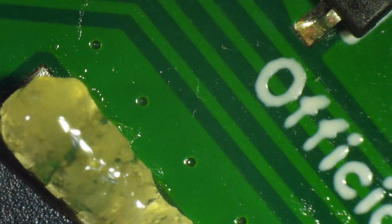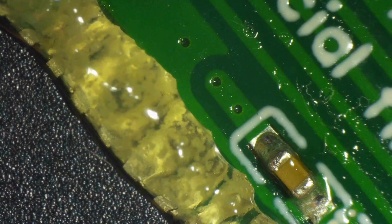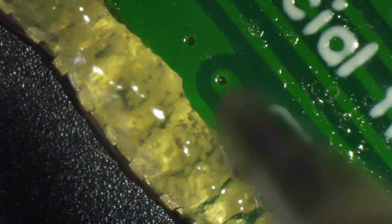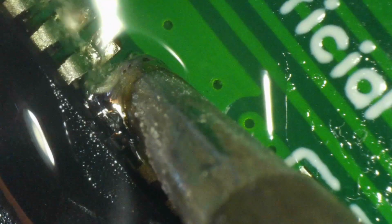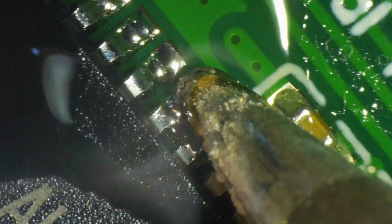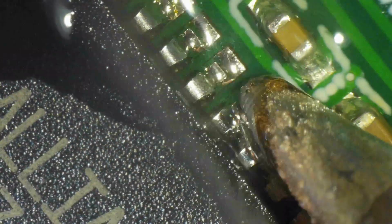So what I would do, not to compromise the stability, I would not drag solder starting from the tacked pins. I will do the drag soldering 5 pins down the row, so I don't reflow the pins that are tacked, because if I reflow them, I will lose their strength and I may lose my alignment. So I'm starting down under. You see some 5 or 6 pins down under. So the ones that were tacked, they are up there, up the screen, and they are still holding the chip in position, in alignment.